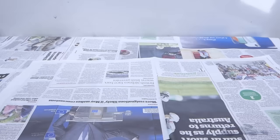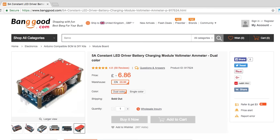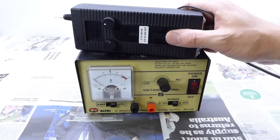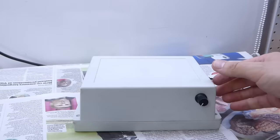So that's all the solutions ready to go. The next thing is the power supply. Small parts like mine don't need anything very powerful — this one will give 5 amps at 24 volts. For my first attempt I used it as-is, but after doing some research I found that a constant current supply gives the best results. So I built this add-on unit — it's just a Banggood switching regulator module in a box. It means I can set the target current and leave it to look after itself instead of having to manually fiddle with it the whole way through.